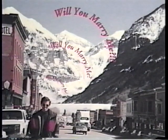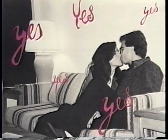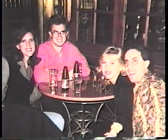A frequent concern about resuming an edit of a still frame picture, such as doing a photo montage, is the presence of flagging or glitches at the resumed edit point. This is caused by the actual edit not taking place during the vertical interval blanking section, which is the non-video signal that occurs between each frame. Ideally, every frame-to-frame transition should look like this if the edit took place at the right time. If the edit occurs in the middle of a frame or field, it will look like this. And that playback at normal speed will give you the glitch or flagging that you've been experiencing.